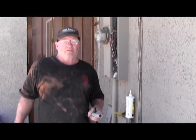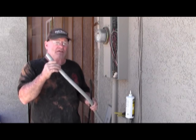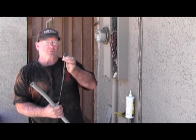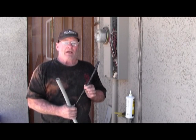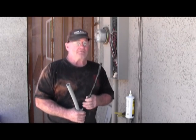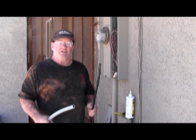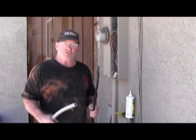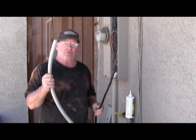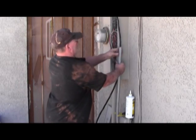The time has come to strip the wire so that we can put it in non-metallic conduit. Now if this were metallic conduit this wouldn't work, because we would have exposed copper and the dissimilar metals would conflict. But if we stay under 15 feet we can strip this and it becomes nothing more than THHN.